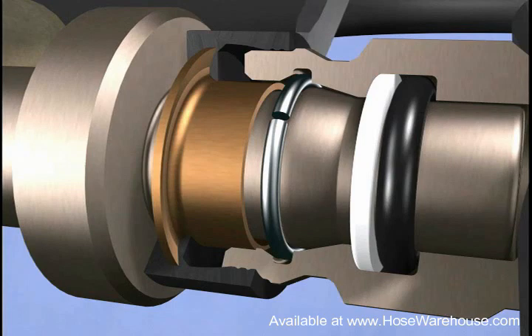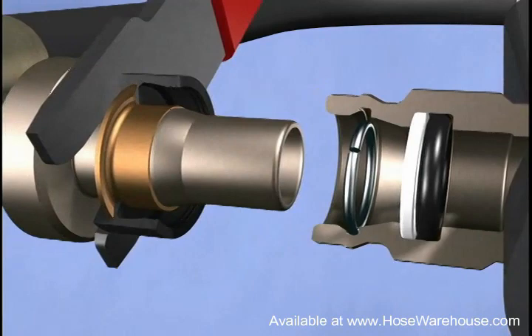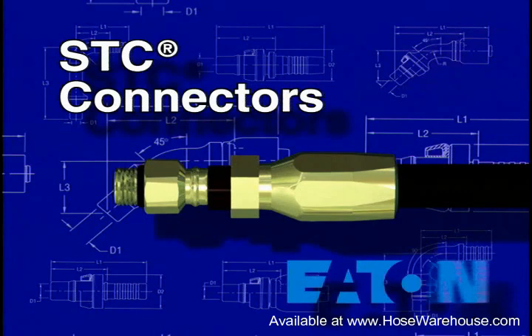When the special tool is inserted behind the rubber release sleeve, it pushes the metal insert against the wire latch ring. This travels up and over the male half ramp until expanding into the groove in the female half, allowing the male half to be removed from the connection.